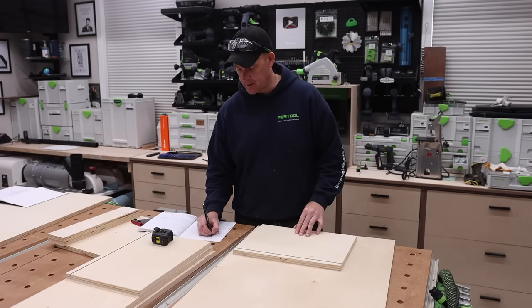Another common question is how long a screw I use. These are inch and three-quarter — that's my go-to for this application, though I sometimes use 2-inch or inch-and-a-half. On something this deep I typically do three screws — it's more than enough holding power. Now we're going to go ahead and put this back panel in. There's a little bit of clearance here to allow for the top panel. The back panel typically helps square everything up, but as long as you cut everything nice and square, it should come together well. Now we can get the top on, and then the last side.